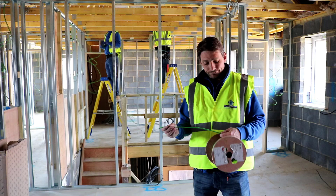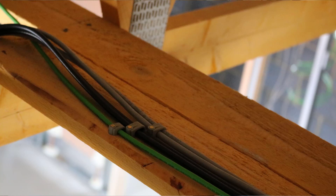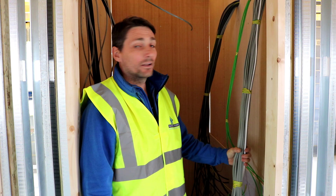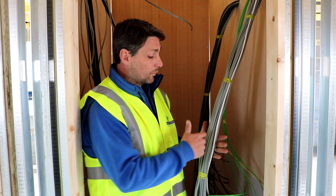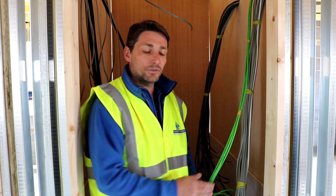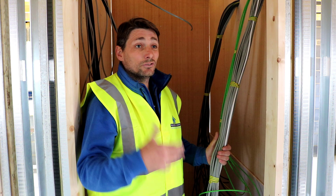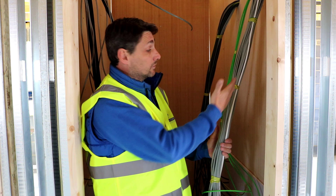This is a low voltage bus cable — it comes in 2-core or 4-core. We wire to the devices in a daisy chain, which reduces the amount of cable used on the installation. The beauty of using this bus cable is you can run it alongside the mains cable without any issues. These are the mains cables wired to each room, each lighting point, each different circuit. These are the bus cables wired from each switch position and stat position back to the panel. With a bus system, you don't have to worry about two-way switching or intermediate switching — we do that later in the software. For mains cables, we don't have to worry about three-plating at the switches or the lighting point; we simply connect each circuit back into the device within the panel.